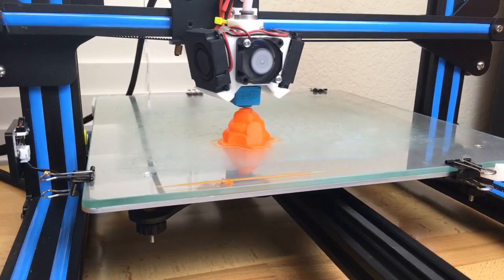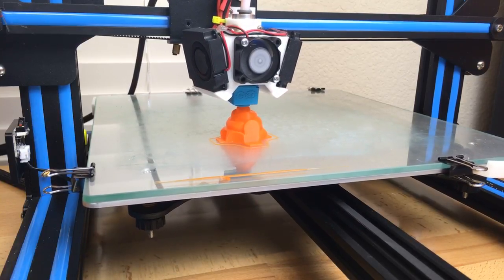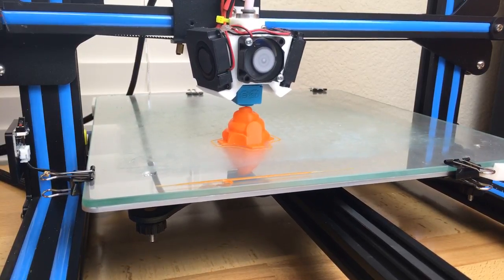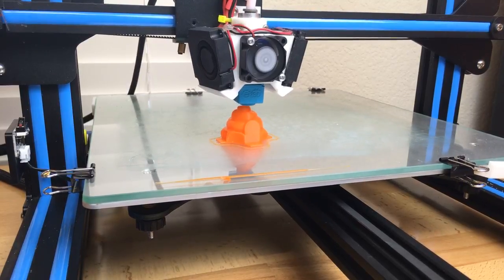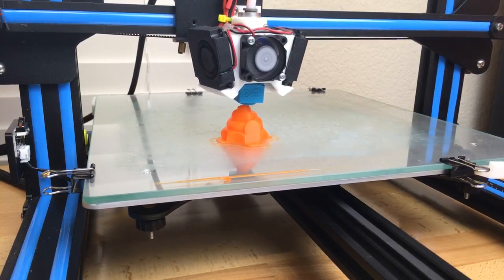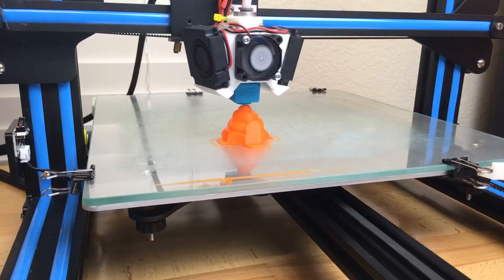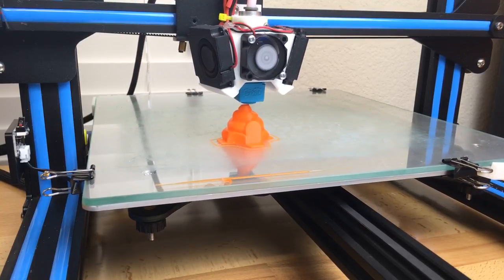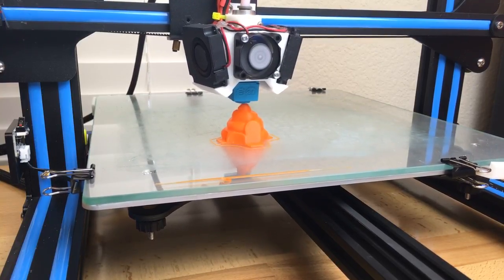Ogie is talking about his Prusa Mark II. He says he likes the auto bed level. He said that he has no problems with PLA prints when using Prusa sold filament, a bit problematic with ColorFabb Economic. Ogie, I'm not sure if you're saying that you had issues with the Prusa filament or with the ColorFabb Economic. I've never used ColorFabb Economic. I've only used the PLA, PHA and the XT, and I've had really good luck with those. The filament that I'm using for this print is actually Polymax PLA, and it is an amazing filament. It's right up there with ColorFabb. Okay, Ogie clarified. He says ColorFabb is an issue. The ones that Prusa sold are fine. Okay, well, that's good to know. I will stay away from the ColorFabb Economic.